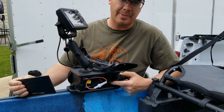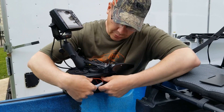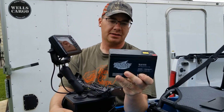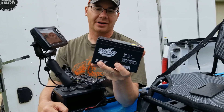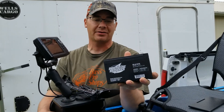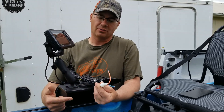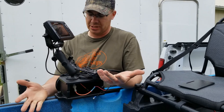There's a door right here and that's where your battery is housed. This is just an Interstate AGM battery — you want to make sure it's an AGM battery. If you use a liquid acid battery, obviously you can't lay it on its side, but being an AGM battery you can lay it on its side, and it slides right in there. Then you just hook your wires up. You've got to have a fusible link — whatever fuse your depth finder calls for, put a fuse in there — and then you put it all in and away you go.